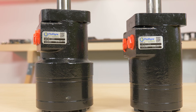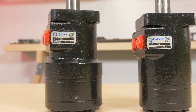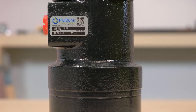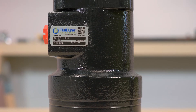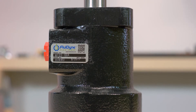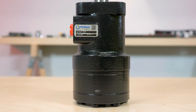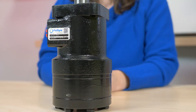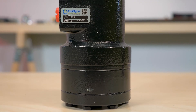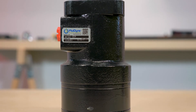And it weighs 13 pounds. The WF103-1004 hydraulic motor over here features a 1-inch straight Woodruff keyed shaft, a 4-bolt flange mount, 1.5-inch MPT ports, and a displacement of 9.6 cubic inches per revolution. Maximum continuous torque is 3,210 inch pounds, maximum continuous pressure is 2,394 psi, and maximum flow is 16 GPM continuous and 20 GPM intermittent. And it weighs 17 pounds.